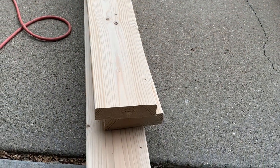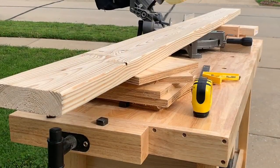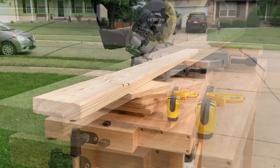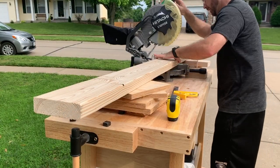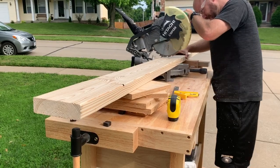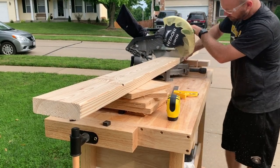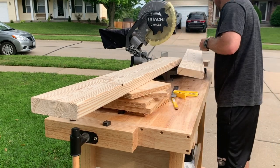The first thing I worked on was the frame, which meant cutting the 2x6s into two four-foot sections and then the 81-inch sections, which I shortened a little bit after that. I just placed them all up on the bench for the miter saw and went to work, making sure that they were square with the frame of the saw itself, and then I supported the piece on both ends with some scrap wood.